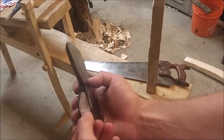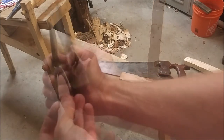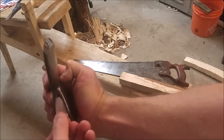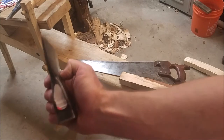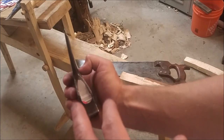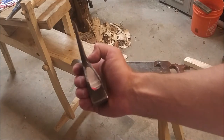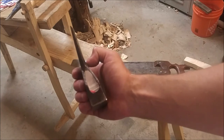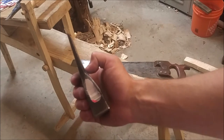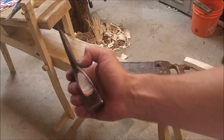I went to the trouble of cutting a small cardboard template to match the shape of the eye. You don't need to make it so precise, but you do not want to undersize this section, because a couple of things are going to happen. The material will actually shrink — this ash is about a year old and still has quite a bit of moisture in it. We have to dry it out, and when it dries out it's going to shrink. So definitely make sure you don't undersize it, otherwise you're going to be making a brand new handle or buying one from the hardware store, which is exactly what I'm trying to avoid.